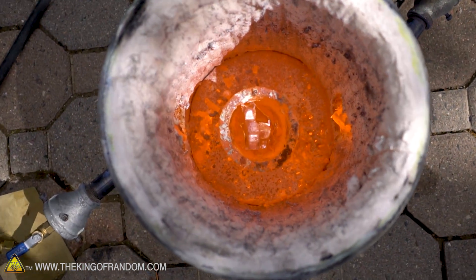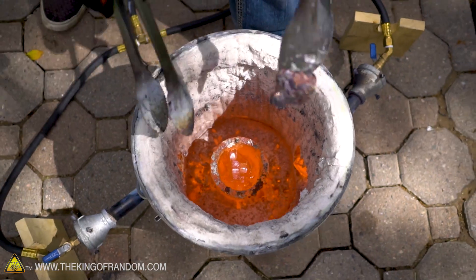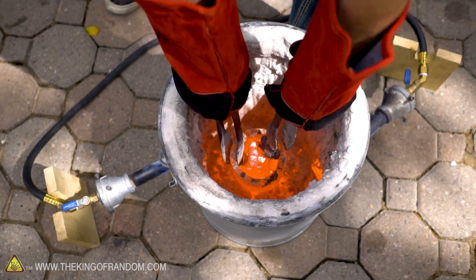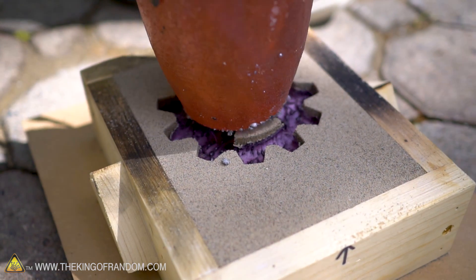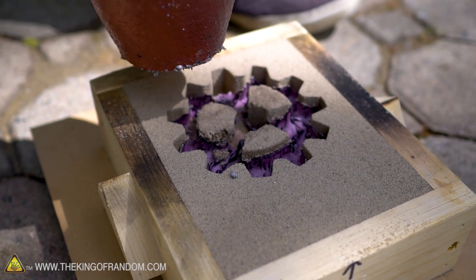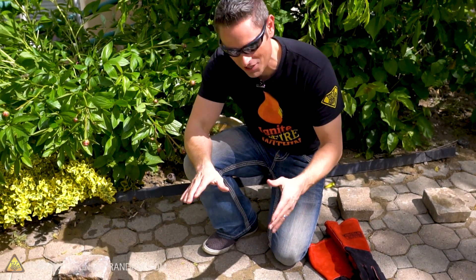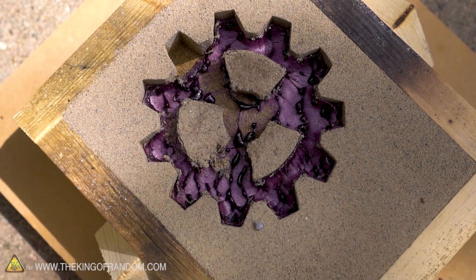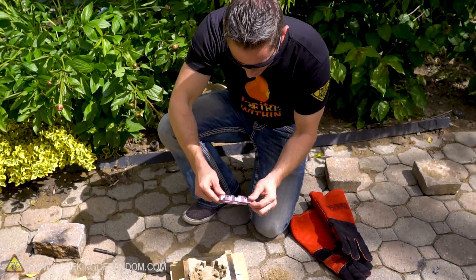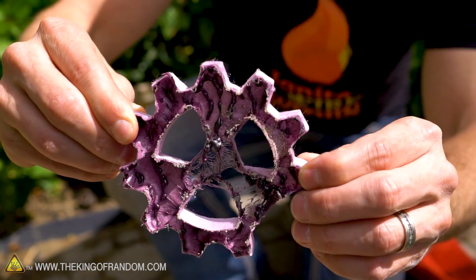It's nice and toasty — you can see it hasn't quite melted yet, and that's okay, because we don't need it molten yet. We're just going to use this to melt the styrofoam. Now we're just going to use the heat from the crucible — look at that, so cool. But I think my crucible touched the top of the sand. It did — so that was kind of a bummer. I got the crucible too close and actually made contact with the sand, which crushed it and kind of ruined my mold. So I'm going to have to use my other styrofoam gear and make another one. Kind of cool though — look at that, it just makes like a styrofoam shell: solid on this side, shell on this side. That's kind of interesting.